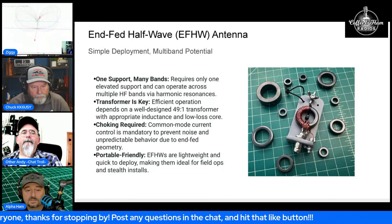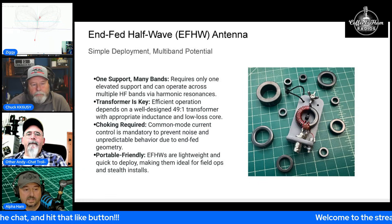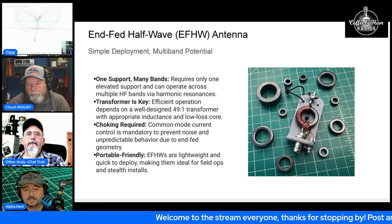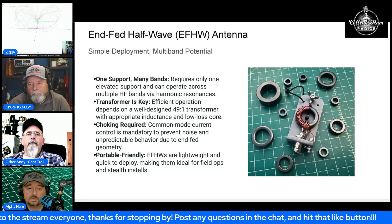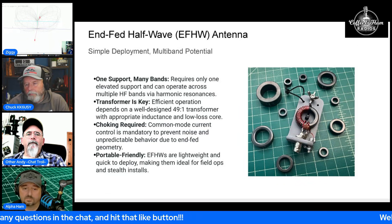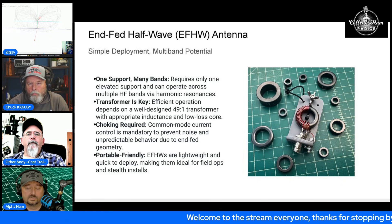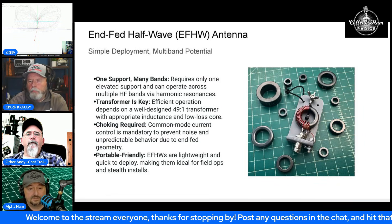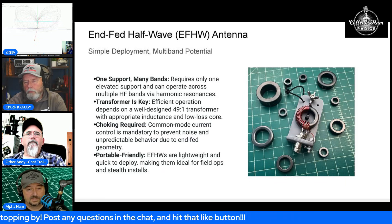People say it's got good SWR numbers, but the antenna itself isn't going to perform as well as it normally would if it acted as an inductor. The other thing to consider is core self-resonance — every circuit has a frequency it's resonant at, and on most cores used in end-fed half waves that's somewhere around 9 to 10 MHz. On a phase chart you'll see an inductive curve that goes up, then immediately drops down, crosses the resonant line, and then you have capacitive behavior, not inductive behavior.